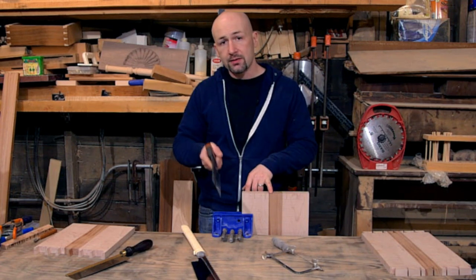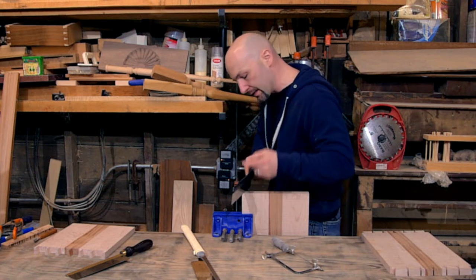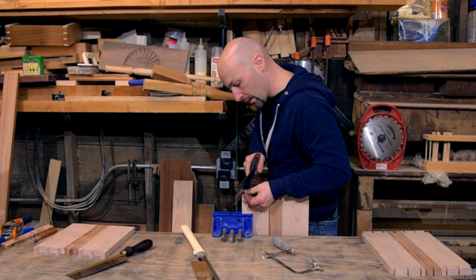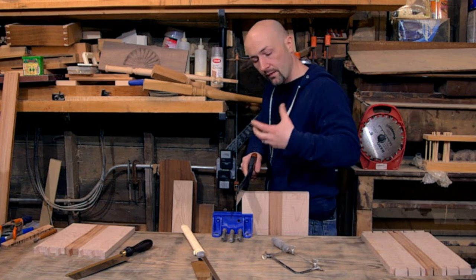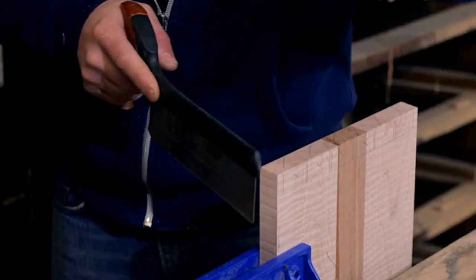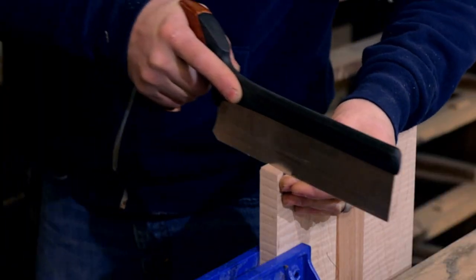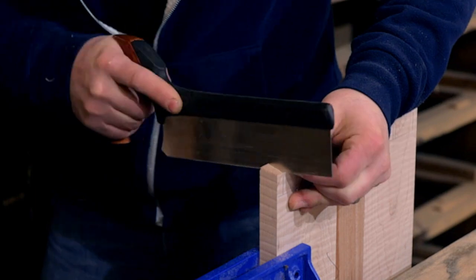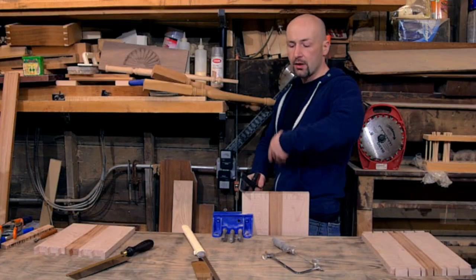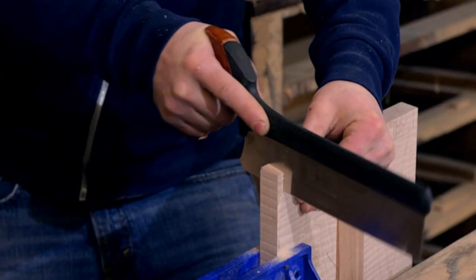So I'm going to go ahead and cut a couple of my pins with this saw so you can see what it's like. When I'm cutting my pins, I need to make sure that I line up on the 14 degrees, and then I'm angling my blade at 14 degrees and then dropping straight down at 90. Every time I use this type of saw, I make a couple of saw kerfs — I draw back a few times to get a trough to start out with. Now that I have a good trough established, I'm going to cut straight down. Remember, we're cutting at an angle here, so I'm going to stop when I hit that marking gauge scribe on each side.